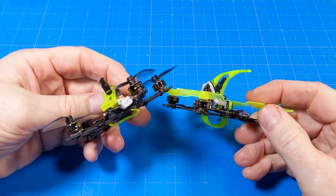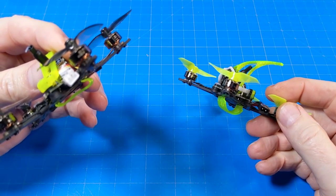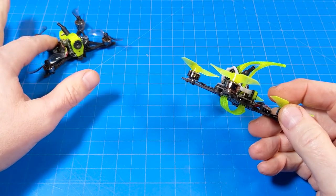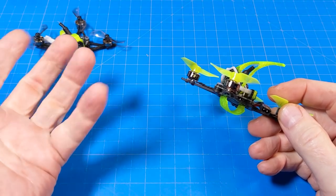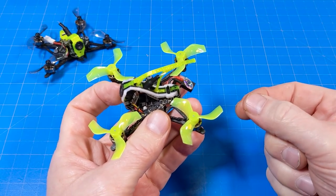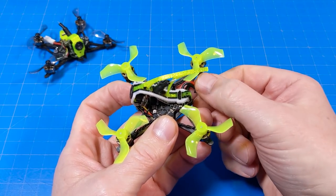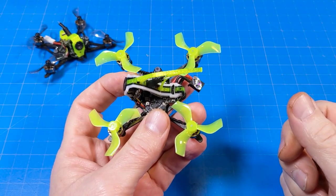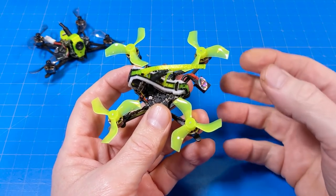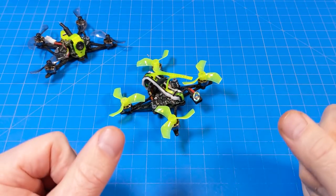The PH2.0 tends to break down — even the best PH2.0s break down, they just take longer to do it. There are also some indications that the solid pin PH2 may wallow out batteries a little bit. I've had an issue on this quad where fully seating one particular battery all the way in didn't power the board, so I had to pull it back just a touch. The GNB27 connectors aren't perfect — from battery to battery you don't always get a perfect connection.